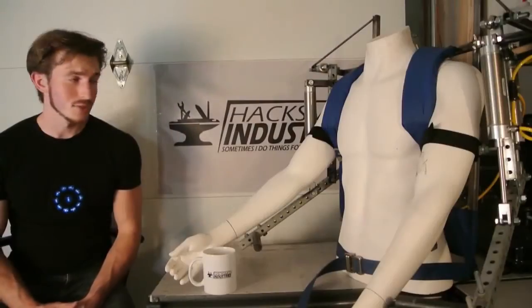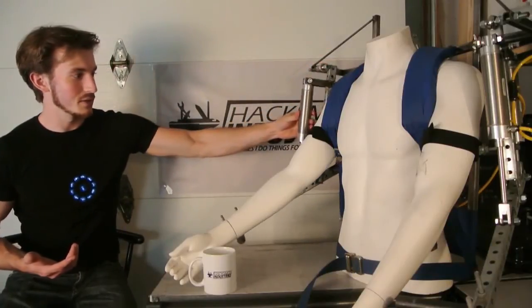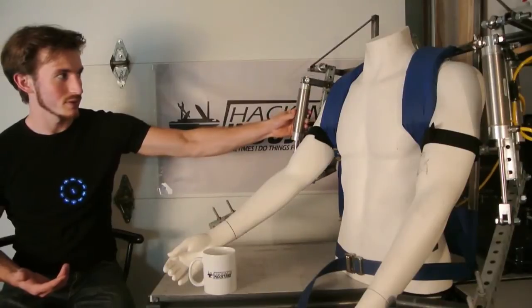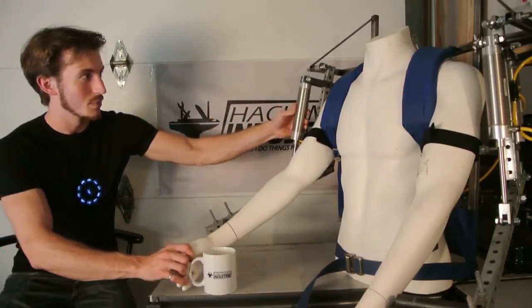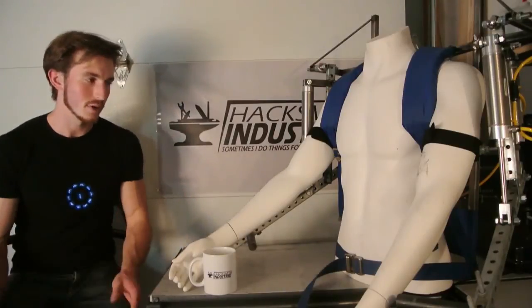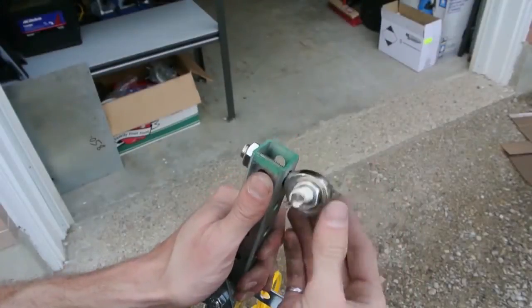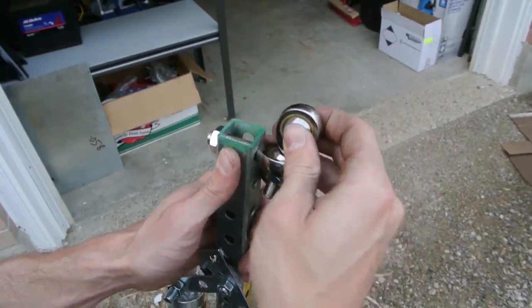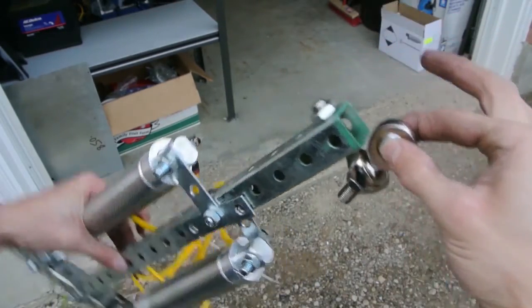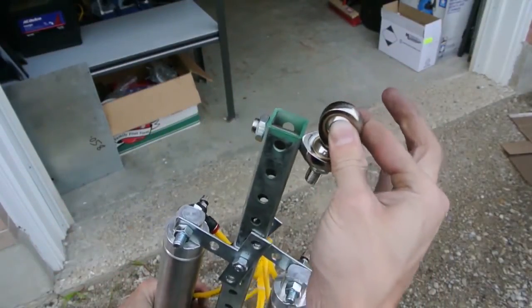Currently I'm using spherical ball joints on the shoulders, which is a type of bearing. The reason I'm doing that is because it gives me flexibility to move my arms sideways, back and forth, as well as a full range of motion up and down — it's attached to the mannequin right now. As this project continues to develop, I will be needing a lot more bearings — on the lower half for all the joints, all the connection points for the cylinders. The ball joint mounted off the arm and the one mounted off the shoulder with a bolt will allow the entire arm to rotate up and down, while the other one lets it rotate around, giving me full flexibility of the shoulder.